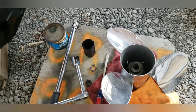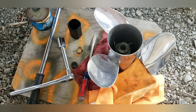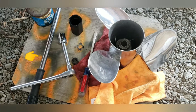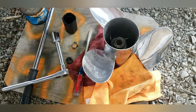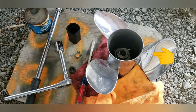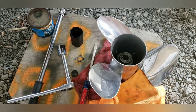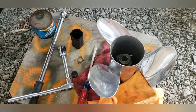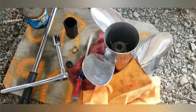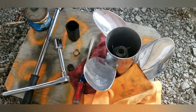First thing, all you need is a little bit of wheel bearing grease — some good marine grade, it's waterproof. You'll also need a torque wrench, a one and one-sixteenth socket, a ratchet, a screwdriver, and all your components to put the prop on. You can use anti-seize and a little bit of wheel bearing grease both. You can use a pair of pliers also, but I use a screwdriver and I'll show you what we're doing with that.